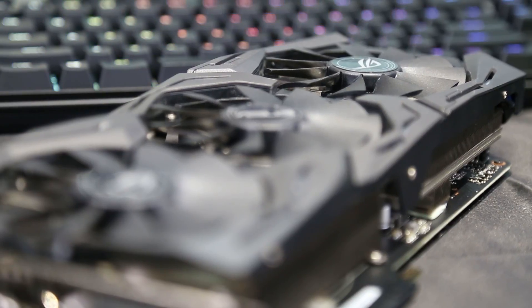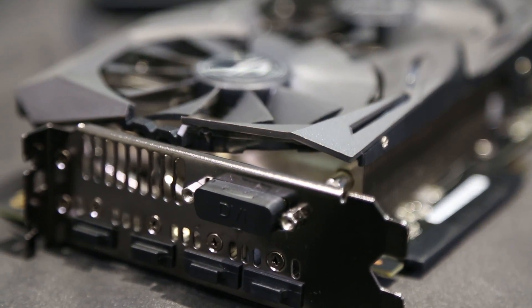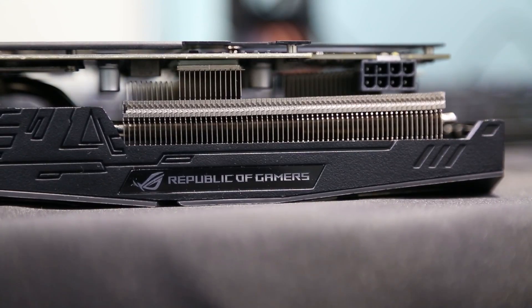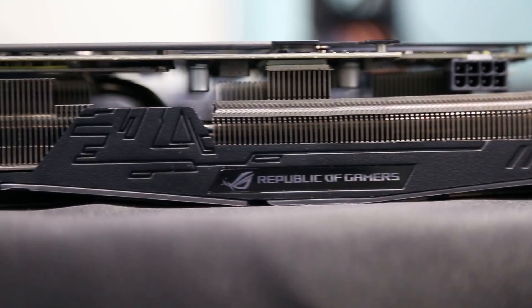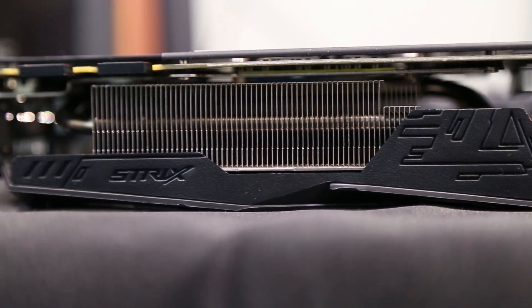Most of the weight of the card is relocated to the left-hand side of the card, towards the back of the I/O. The reason for this is to balance out most of the weight towards the back, and this helps reduce the torque from the far end of the card, ensuring the card can be secured with the chassis screws. It is also sandwiched with both the back and inner metal plate, ensuring the card stands horizontally at all times without the concern of card sagging. This new design also helps to prevent physical conflict with compact chassis that have narrow side panels.